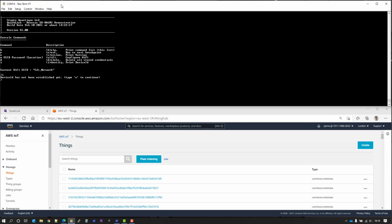What this means is that the software has not requested that the secure cryptographic engine inside the RA device generate a key pair, an asymmetric key pair, as yet, because that's how we extract the identity. So if I click next, what will happen now is the device will first connect to my Wi-Fi, and then it will ask the Renesas device to generate a key pair. From that key pair, the device will hash the public part and provide that to me. The cool thing about this from a security viewpoint, of course, is that these identities and these keys do not leave the device. They're not injected in any way, they are generated by the silicon itself.